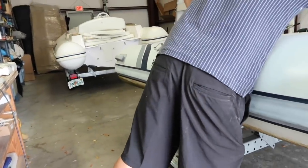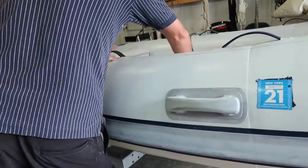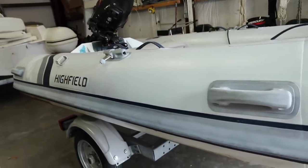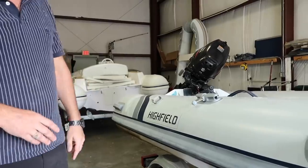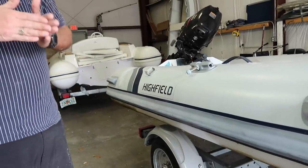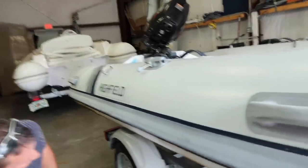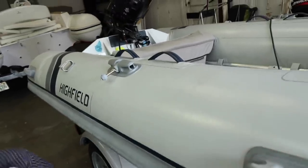When you go to put it down, make sure there's no air pressure in it, because if there is, that air is going to want to push while the glue is trying to cure — it's going to bubble out. Do it deflated, no pressure, so that glue on the boat and glue on the back of the patch bind into those holes. "Can it still be inflated a little bit?" Oh yeah, just so there's no pressure in it.